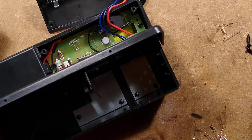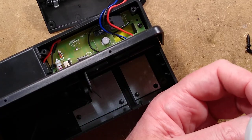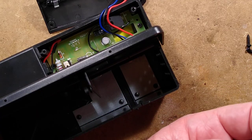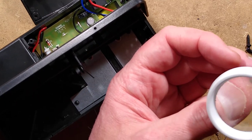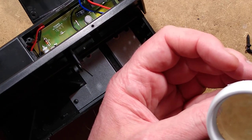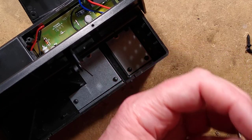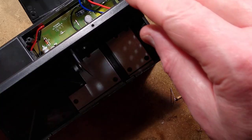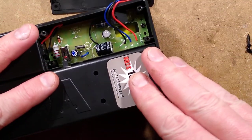What was the value of that resistor? Let's get this under the scope. Grey, red, orange — that's 82K. That's quite a high resistance. So I'm not sure how this detects; we're going to have to suck it out and find out.